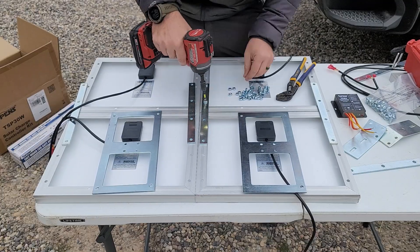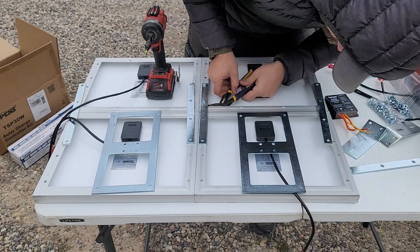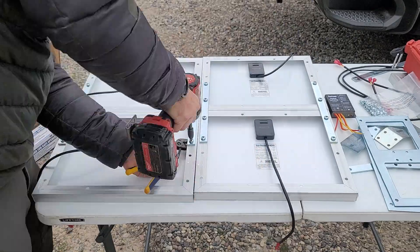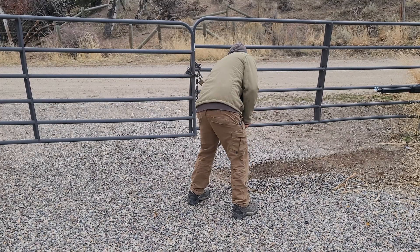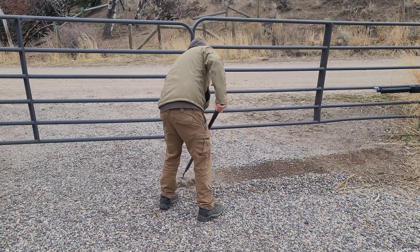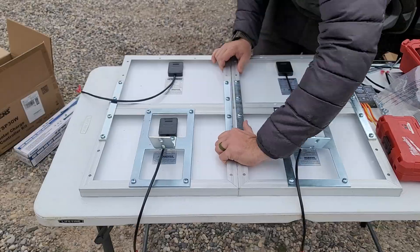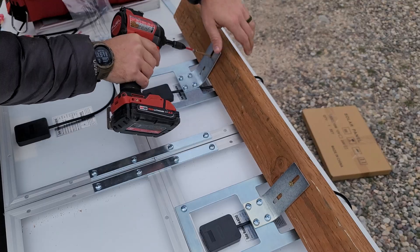Using the hardware included with the solar panels, I'm putting them all together in a top-to-bottom setup and using one last bracket across the top to hold them left and right. It was pretty tricky because there's not a lot of room to work behind the panel frame, but I managed with channel locks and a Phillips bit on my drill. Meanwhile Kyle was stuck doing all the trenching — we need a wire to run from the right post to reach the control box mounted on the left post. I got the brackets fastened together and built the treated lumber mount using outdoor-rated construction screws.